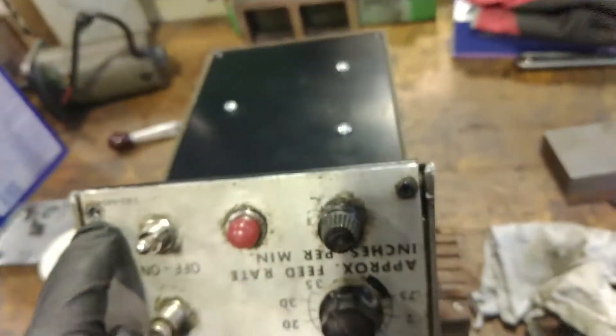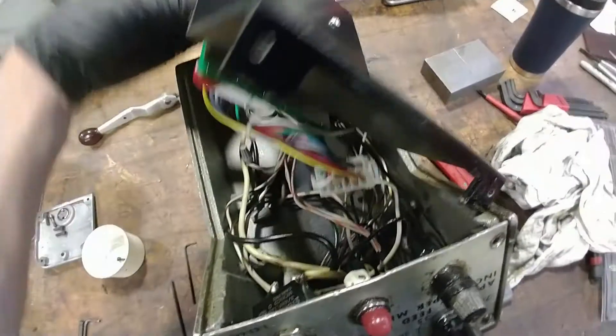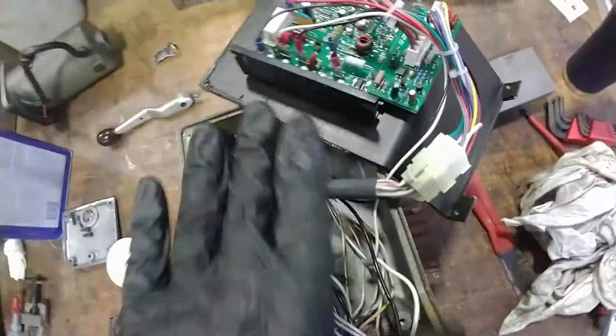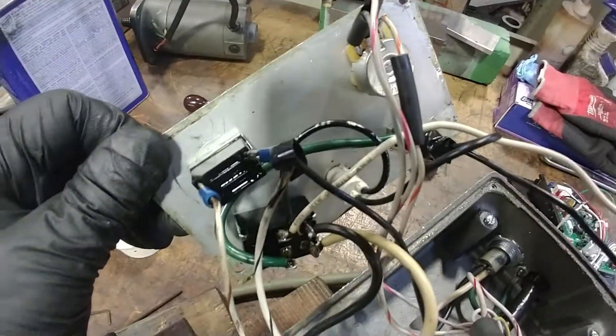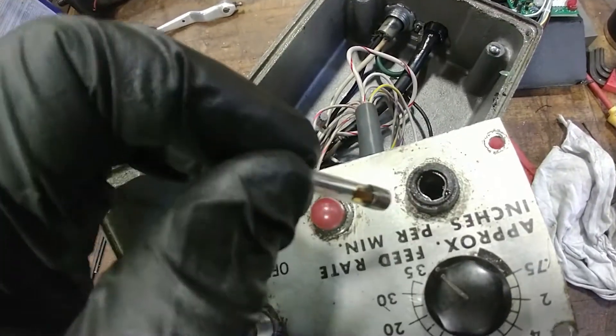Typically these things have cap head screws — there should be six of them, but this one's missing two, so we'll get replacements. The face plate looks pretty beat up; if I can't get it clean we'll replace that too. This has been repaired before — this is a replacement board; original boards mount to four screws upside down inside the case. This one has a quick disconnect so I can just take that off. Two wire nuts for the input power, and there's one on the back of the control panel. Pulling the fuse — there's oil inside the fuse.